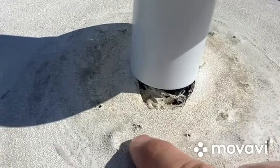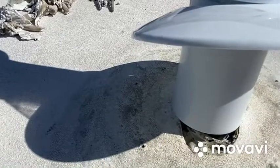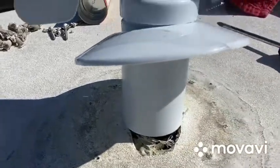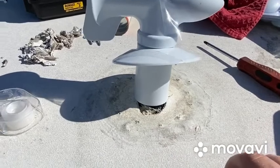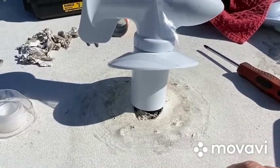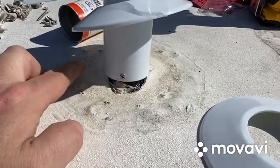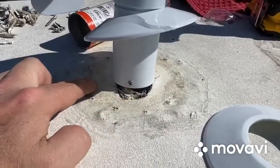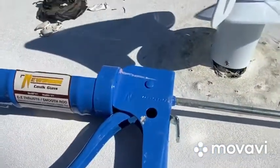I'm going to drill three holes and screw it in, then start to caulk it off. We're going to put some lap sealant on each of these holes before we slide this part down, then we're going to seal the whole thing up really well. So far it hasn't been too difficult - just one of those where you get into it and there's something else behind it. I drilled one hole and slapped a screw in. I'll go ahead and drill the other two holes, put the screws in, then start caulking.